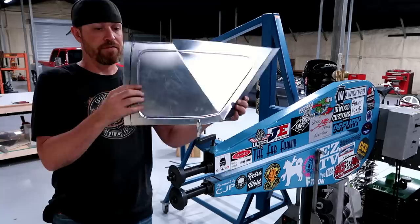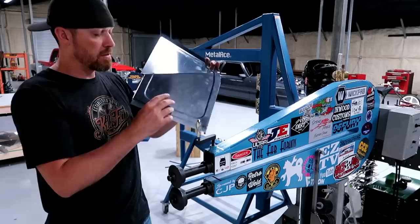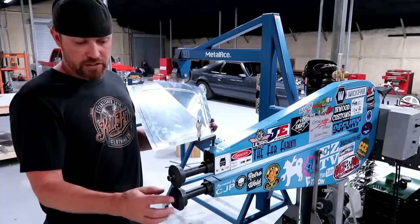Now this last one I'm gonna do is out here on the edge. I've kind of shown this technique before, but because it's not a straight line, you don't want to break it in a sheet metal brake, but you gotta bend this 90 degrees. The way I'm gonna do that is with a tipping die. I'll change out this lower one to just a rubber wheel, and then basically we'll just run this thing